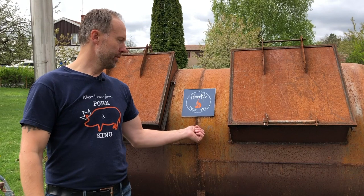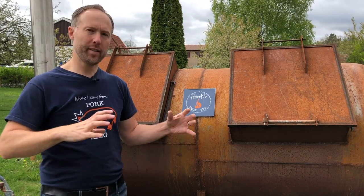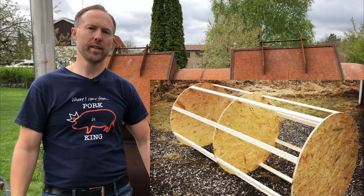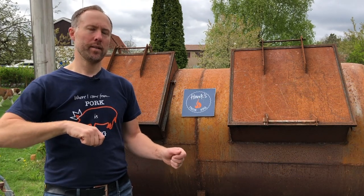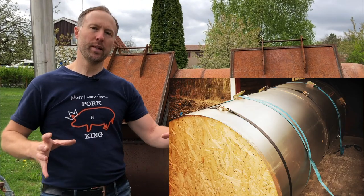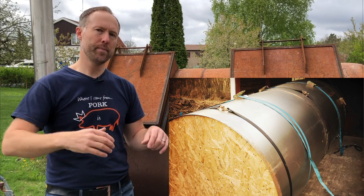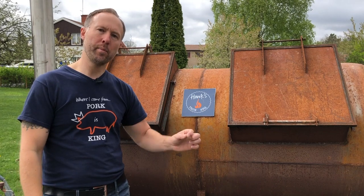Building a tank like this required getting technical. I needed to build it from the inside out, so I built a big wooden frame — what I call a jig — a full-size wooden frame. Since it was just me working alone, I had to be smart about it, so I built the cylinder from the inside out, kind of rolling it up as you can see in the pictures. I put straps around to hold it in place and then started tack welding to seal it up.